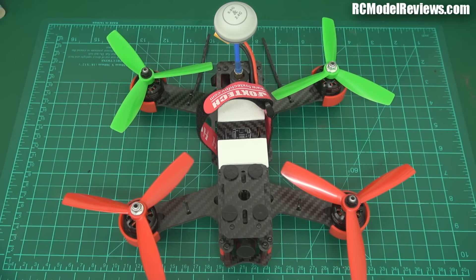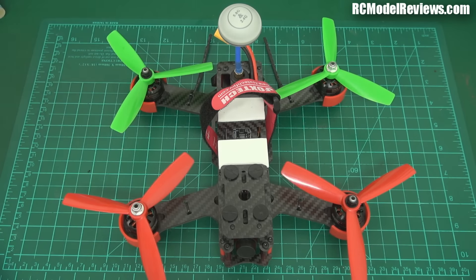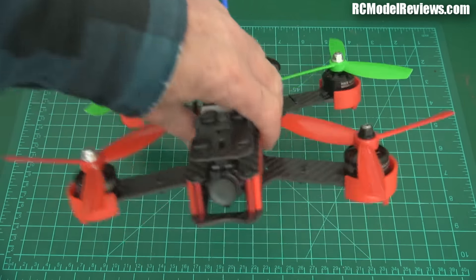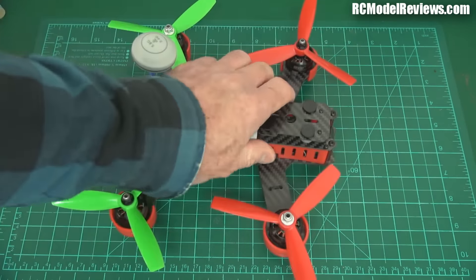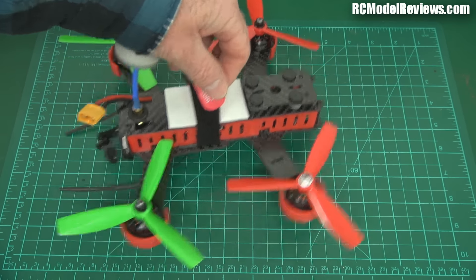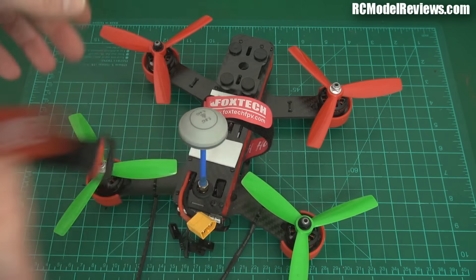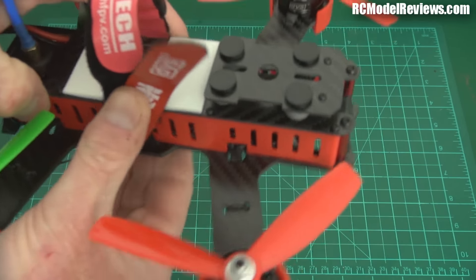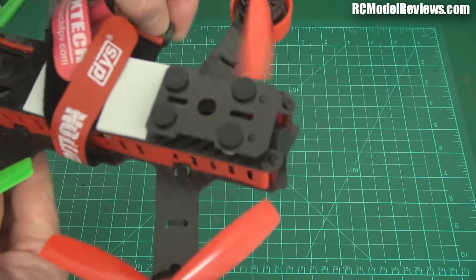Foxtec have got a Lightning too - very popular name for mini quads. In the last video on this, which I'll link to in the description, I mentioned some of the shortcomings. For a start, this crappy 2.4 and 5.8 GHz antenna - these are useless. Also the camera is mounted to the Mobius plate and it bangs into the carbon frame down here - not good at all. And you'll notice this has got a Foxtec battery strap on it. The strap that came with the DYS isn't big enough to go around the entire body and include a battery - it's too short.